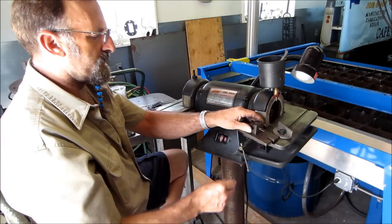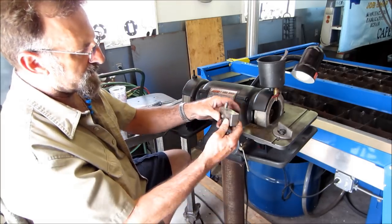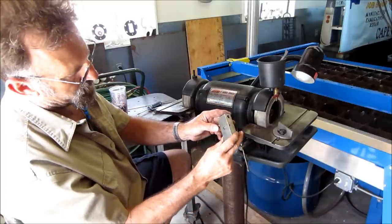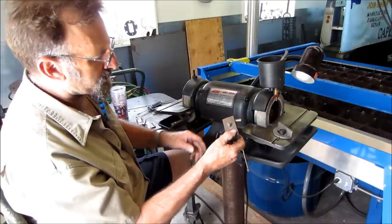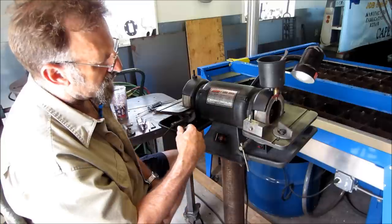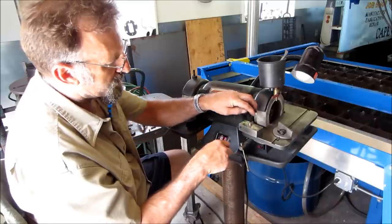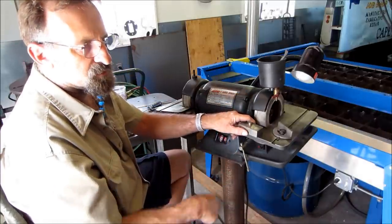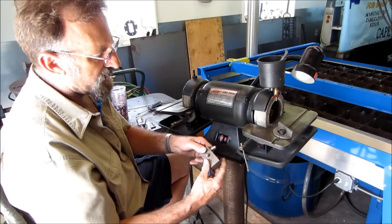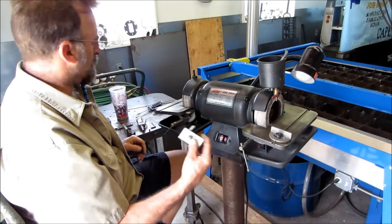All right, that's just one kind of grinding apparatus. Here's one that was in another box there. It has two stones in there, and I don't know who G. Parker is, but this was the tool that he made up, and it's pretty nice. It was able to go with a magnetic base like that, or like that, and you can sharpen or dress stones in that fashion, okay? If this was pointing out of here, I would use this block here to go ahead and dress this stone here.